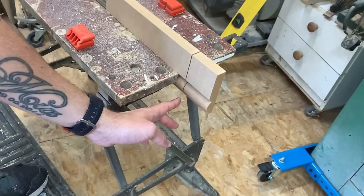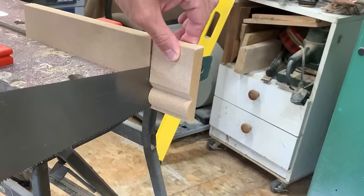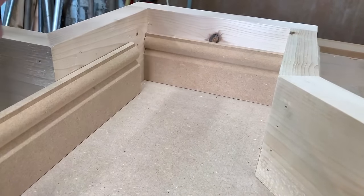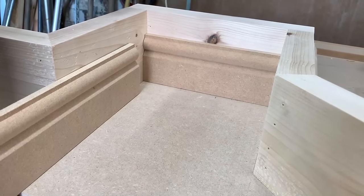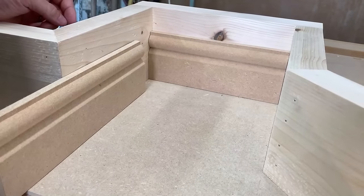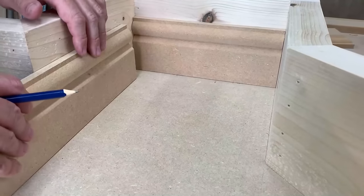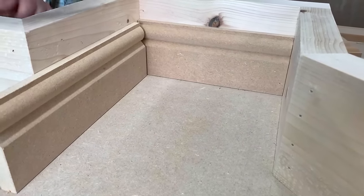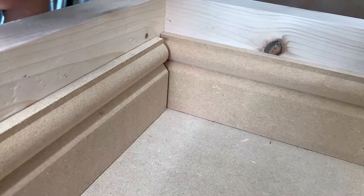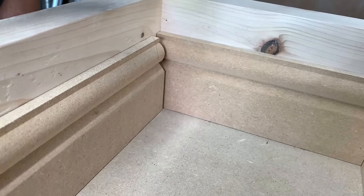Before you break off, just go careful at the edge of the moulding. In an internal angle we don't mitre it because it tends to open up and you always have a gap — no matter how many times you caulk it, it'll always open up. Plus if it's not exactly square then your mitre won't be accurate. So what we do is called the scribe cut. I've actually prepared one there and that's what it looks like — it just sits over the other piece of skirting board. The way we get the shape is to first draw an accurate 45 degree on the piece, and if that line carries on down it follows the profile shape of the skirting and gives us the shape to cut out.